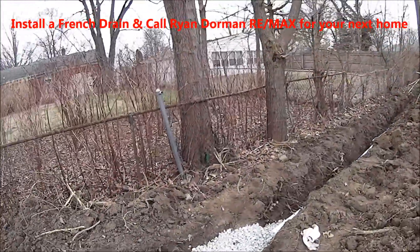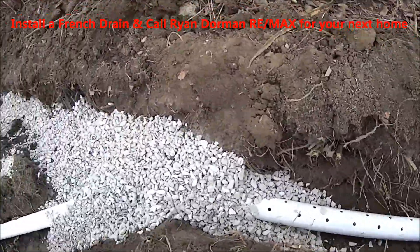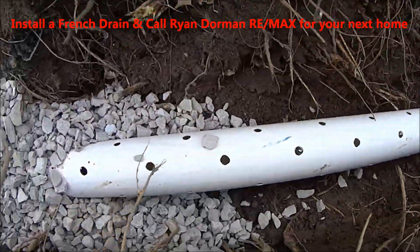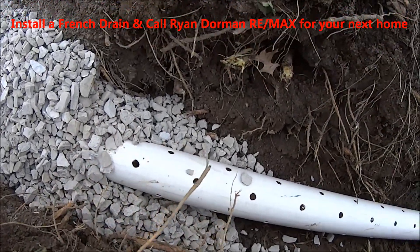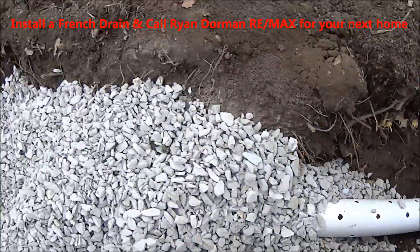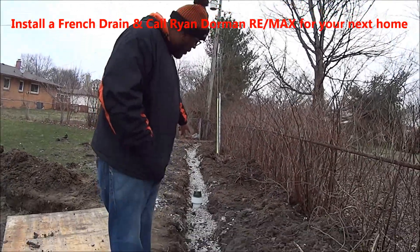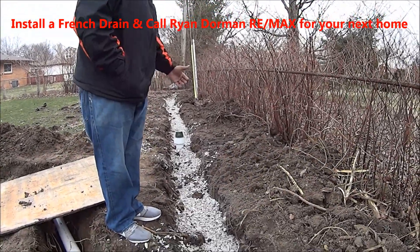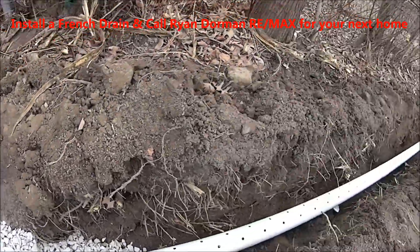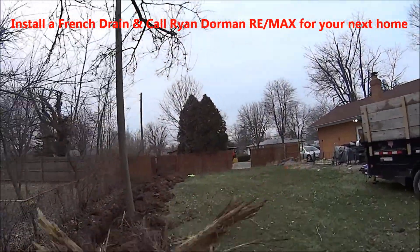We're going to rock this over here and fill this in. We've got a wide joint that ties in here, and then this line is going to run the corrugated pipe — as you can see, the holes are at the top, not at the bottom, so water won't spill out that way. Water will come in and fill up into the pipe system, move down the back of the line over to the other portion of the front yard, and drain into the city's drainage system.